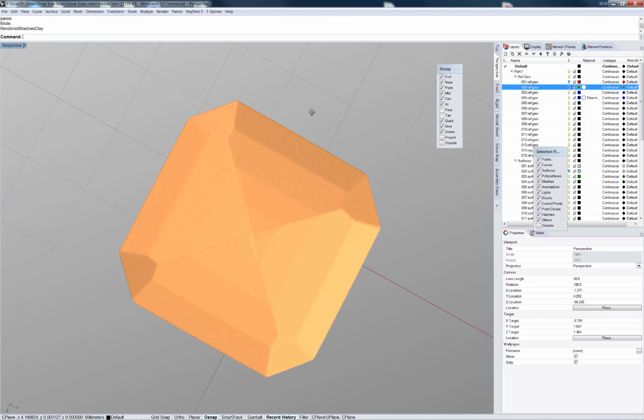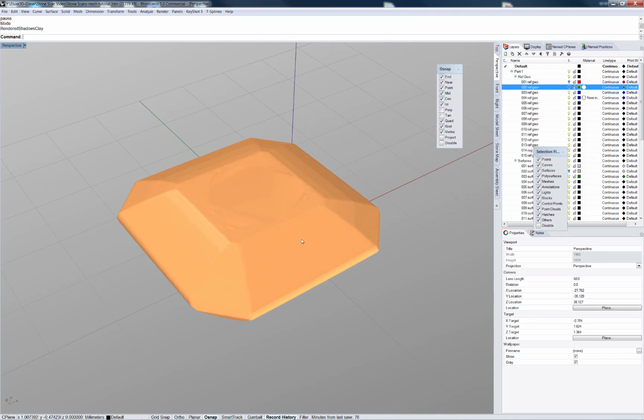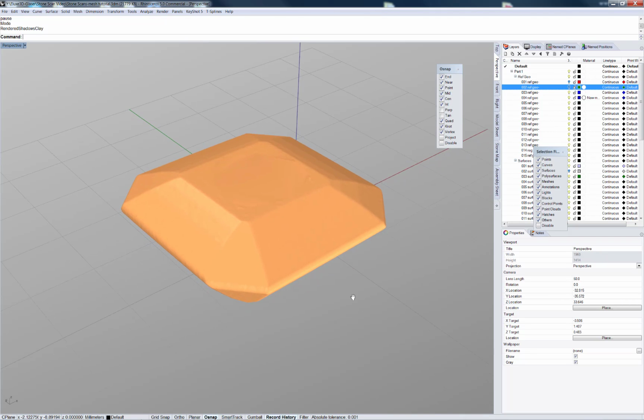So that's basically the process at this point, and it is a good representation of that. Now, in the old days, by the way, we used to use cuttlefish bone and make impressions of expensive stones, pour in low temperature metal like Babbitt metal or metal that's used in sprinkler systems, and then that replica would be used for the jeweler, and the stone would go into the safe until the time it was going to be set.